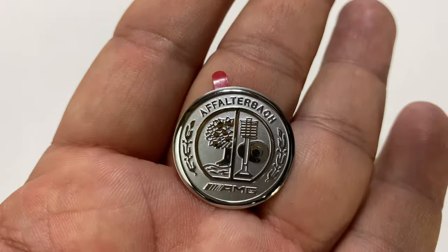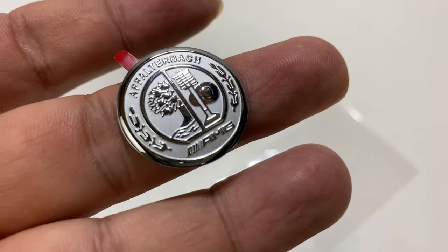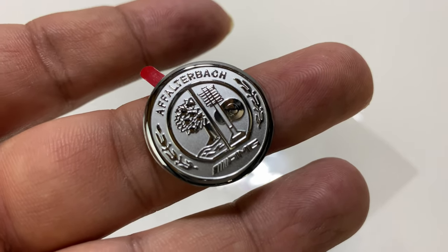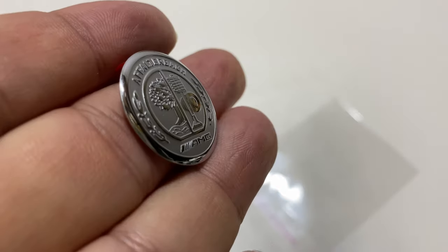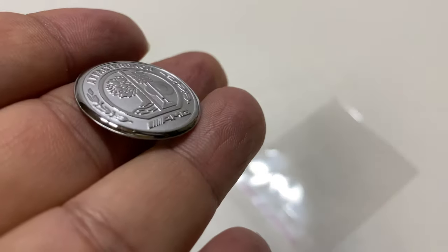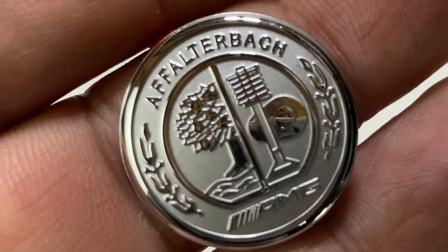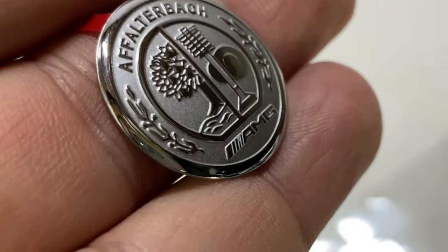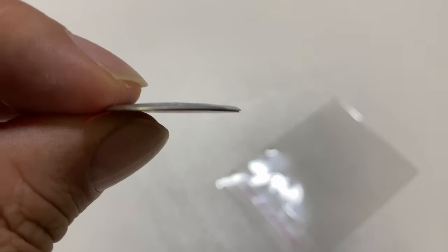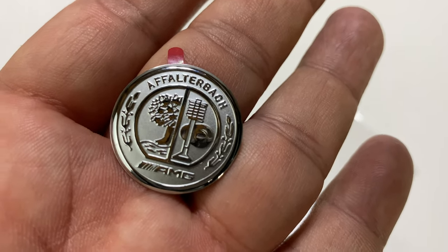I found this little emblem — it's actually for AMG Mercedes, and it's also 24 millimeters. The nice thing is it should fit no matter what, because if my button is just 24 and a half millimeters, it'll fit on top and probably won't go right to the edge, but that'll be good enough. I thought this might just add a millimeter of height and make it more tactile so I can find it and press it. It's metalized plastic with a chrome finish — a stamped molded piece. It says AMG and has some iconography I don't know, but it looks pretty nice. It's also slightly domed on the bottom, so because my button has just a little curvature, it should fit well even though it's not designed for this.